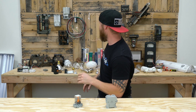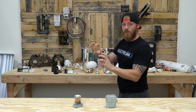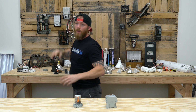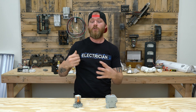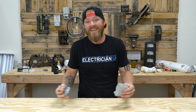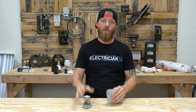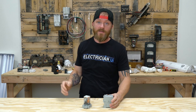However, lighting contactors — like this one or this one — you can add auxiliaries to them, so you can move back and forth whether some of them are normally open and some are normally closed. So they have a bit more functionality, but it's kind of the same thing — it's just limited to usually two or three things, or anywhere from two to 12 in that case.